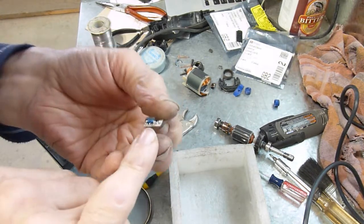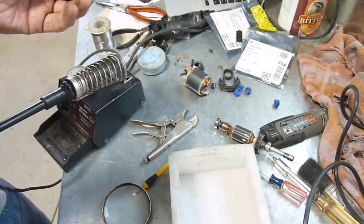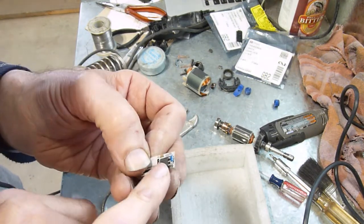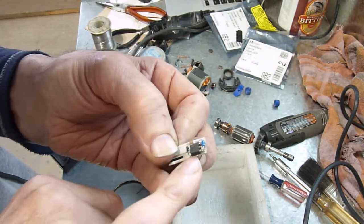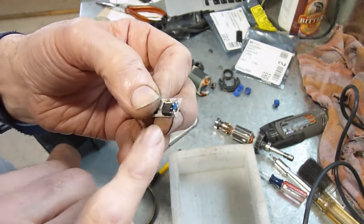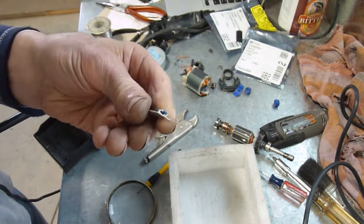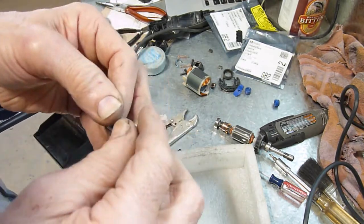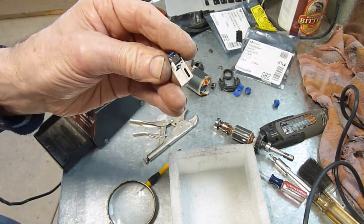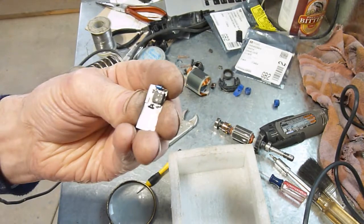The diac is a little bigger, so I've bent the legs around, got it into place, and soldered it — otherwise I couldn't see it. I've bent the legs around on the triac and soldered those into place. I've checked everything with an ohmmeter — nothing is shorted that is not supposed to be shorted. I soldered the tab onto these two lines, which is where it's supposed to be. That leg is not connected, but this is the same function so I should not need that connected. Now to put it together and see if I've got clearance with the wiper, and if it makes good contact with the 850-ohm variable resistor. There's the capacitor that feeds into the hybrid circuit.